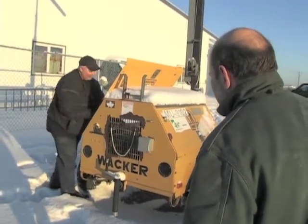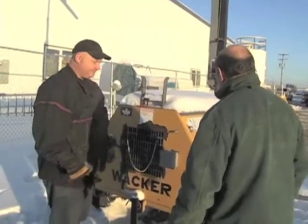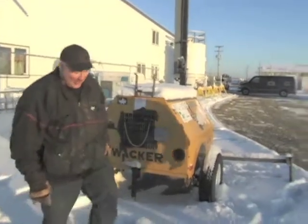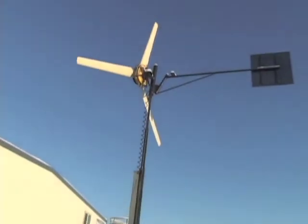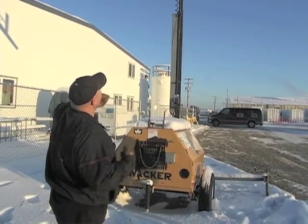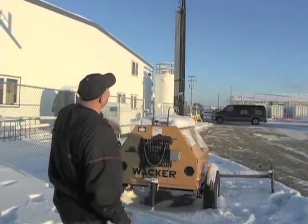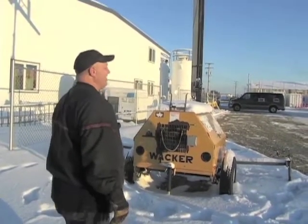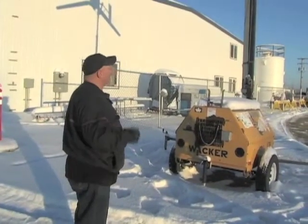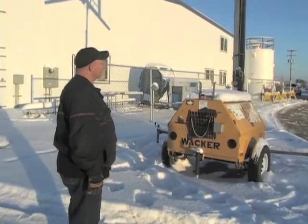You're imagining taking this on bumpy roads — what would you do with the mast? Would you leave it up as you travel? Unless you wanted to create power, I probably wouldn't want to do that. This mast actually cranks down height-wise with that top crank, and then the whole thing will bend and lay down. It folds up into a nice little package. You can pull the blades and turbine — there's one bolt holding them and it just lifts right off. Two guys to unload the big one, or one real strong guy. You can also loosen the blade bolts and fold the blades up into a nice little package and lay them on a sled.